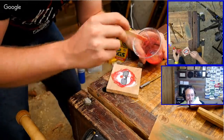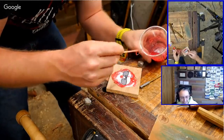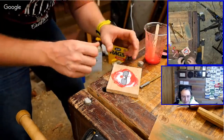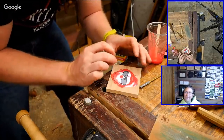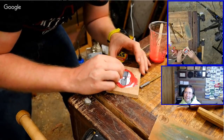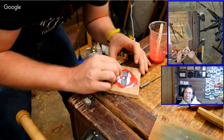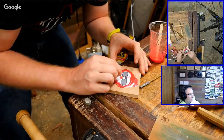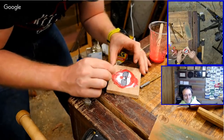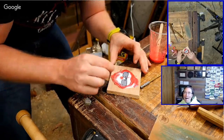Once this sets, I will come back in and carve out the glasses and do the same thing on those, then fill in the glasses. I can take a card scraper and smooth it down. I have this little scrap of wood that I'll use to work the epoxy down into those holes — I don't want any bubbles in the holes, otherwise when I scrape it off you get a bubble and no epoxy. I'll just go around the line making sure everything is in these thin spaces, and then we can set this aside.